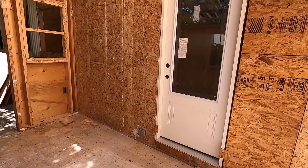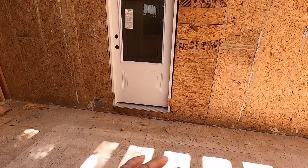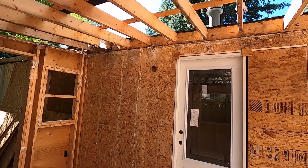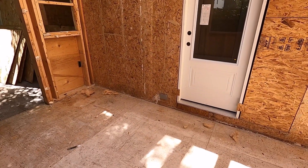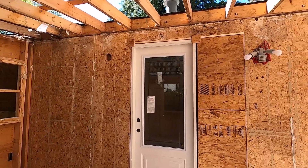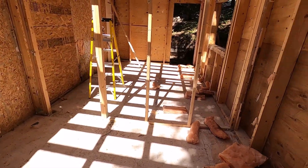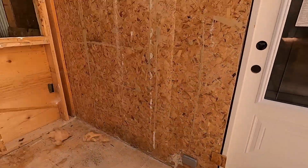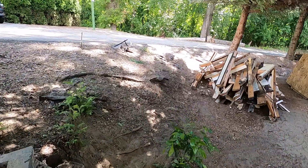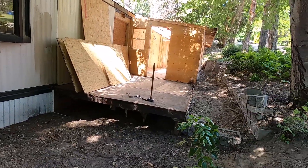This is our new back door. This area in the new construction is going to be a little porch — I'm going to build it with treated wood and it'll have wood planking on the floor, all exterior stuff. I'm going to put a little roof over this because I'm planning to have this as a little outdoor cook area. It's right off the kitchen, and there'll be six-by-six timber posts holding up the roof with recessed lighting and steps going down into the backyard. This home always looked like it was sitting down in a hole because of this bank.